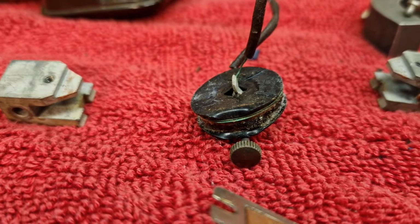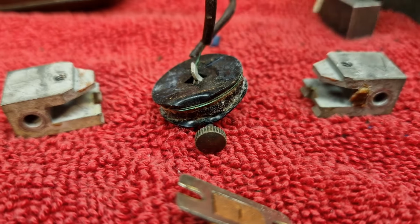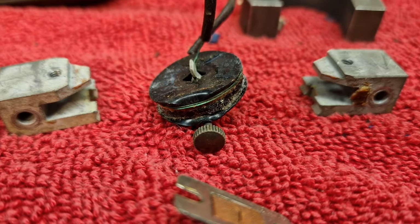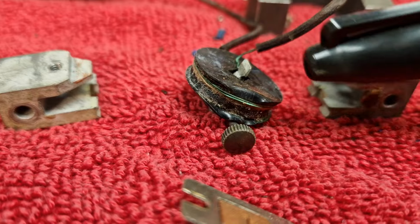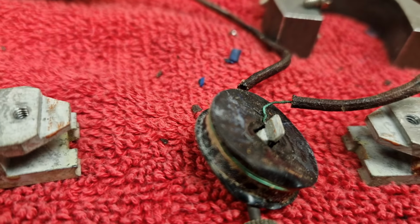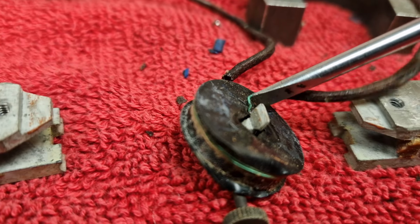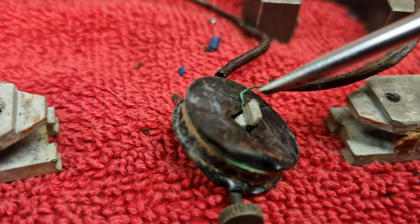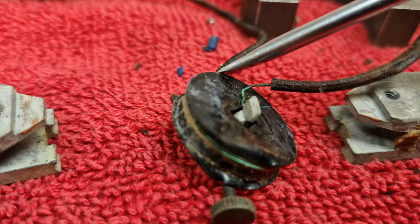So now I've got the old coil out of the pickup. You can see these are the side poles and the actual main magnet. Such a tiny little coil. I mean, it's really hard, it's like the end of a Sharpie pen here. You can see that it's tiny. These tiny little wires on here, as you can see, have gone quite a greeny colour. It will be enamel wiring, sorry, but this is normally silk covered, and it just corrodes away.